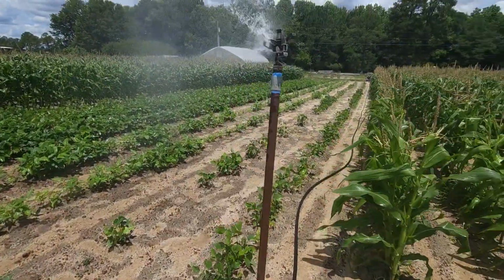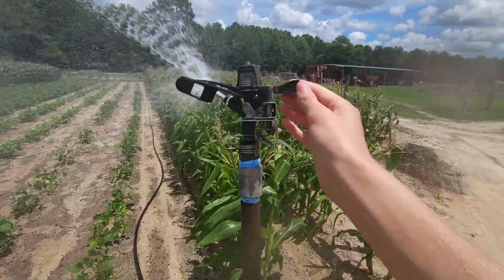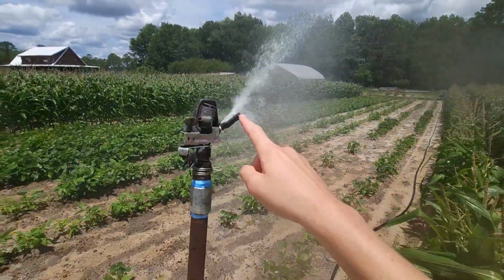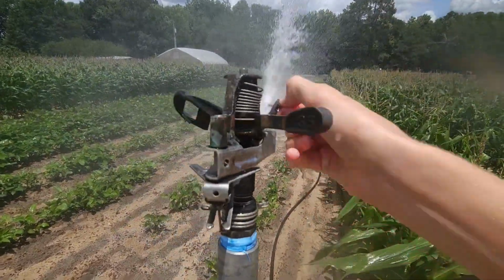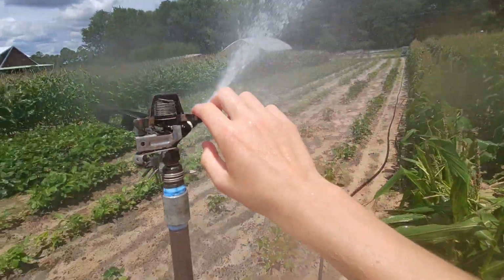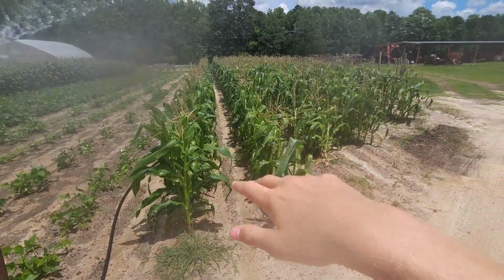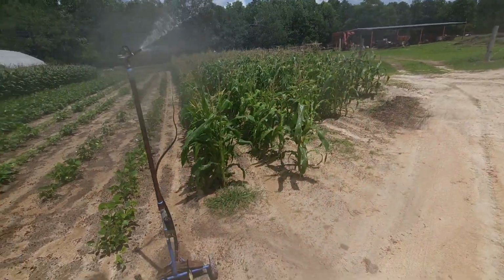This Traveler, if y'all ain't familiar with how to set these sprinkler heads, this is a Rainbird 35 head, and I got a special tip in it that's got a screw on it. And if you don't know what the screw does, you can adjust the screw. You see that screw's breaking up the water stream. Well, when it breaks up that water stream, it makes the sprinkler shoot a smaller stream of water right here to wet this right here, this close to it. If you didn't have that, then it wouldn't wet this right here very good.